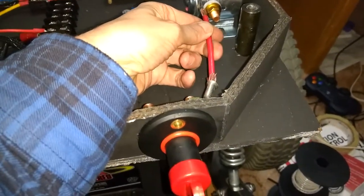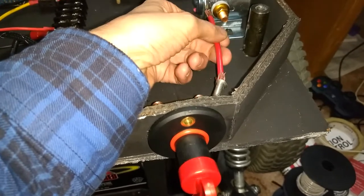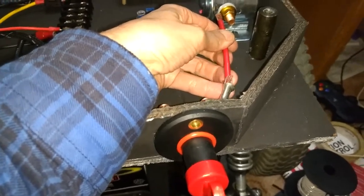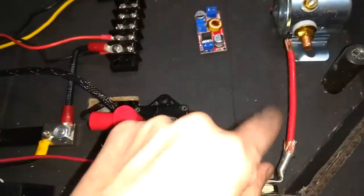This cable here is only rated for 50 amps, so I can't put more than 50 amps through these. Well, I probably could — it's probably not going to hurt it — but I have to be careful. So I'm going to try to limit this with fuses.